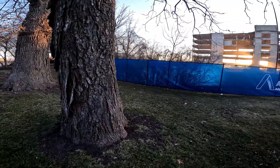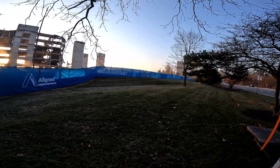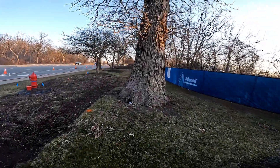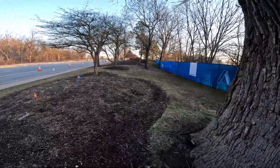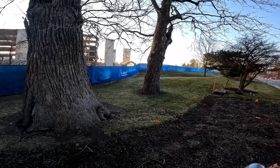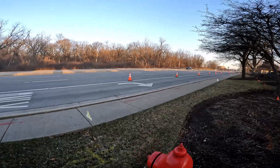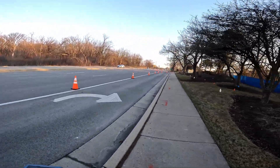With my sweep I'm not doing a 360 because that end is already located — I know my fiber is going out this way. So I'm going about 30 to 40 feet out where the handle is, and I'm going to sweep this whole parkway to make sure it didn't loop all the way out to the curb.